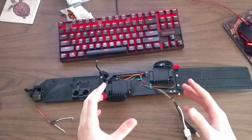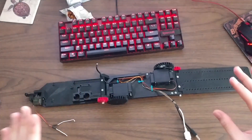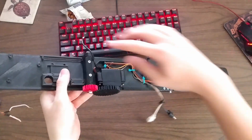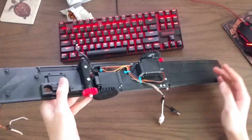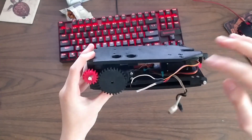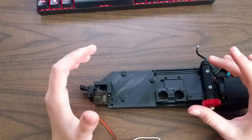This is actually how this robot is going to work, by using the concept of angular momentum to change its angular velocity so that it lands flat on its back. It's going to change its moment of inertia by opening and closing its legs like this. When it's open, the mass is far away from the center of rotation, so the moment of inertia will be higher and the angular velocity will be lower. But when it closes, the moment of inertia decreases because the mass moves closer to the center of rotation, so the angular velocity will increase so that momentum stays constant.